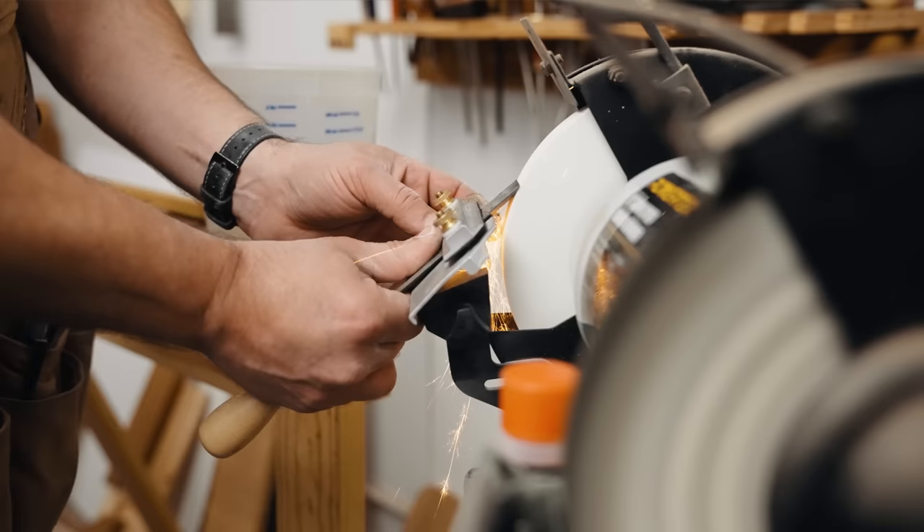Let's talk about some cross-grain examples. I purposely cut this really far away from my line to show you a few things. If you had a rabbet plane or router plane, that might be a good opportunity to use it — but only right at the very end when you're really close to your line, because a plane only takes a shaving at a time, whereas with a chisel you can take off a lot. When you're going with the grain, the wood wants to split the way the grain goes, so if your grain is very straight there's low risk of splitting past your line. That's part of why you make a marking knife line, and you want to make sure you've got the brakes on when going with the grain. One hit can take this all the way down — see how it split that much with just one hit? You need to be really careful when hammering. Always do the long-grain portion before you do your end grain.